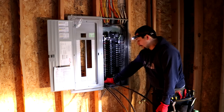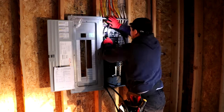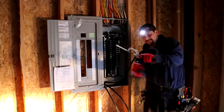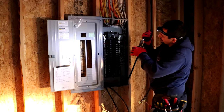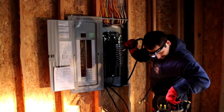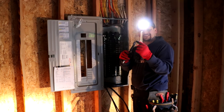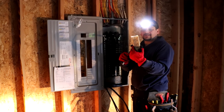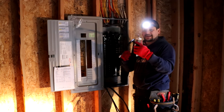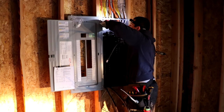I'm going to route one of these first and then show you what it looks like when I'm all done. This is aluminum wire, so it requires that you use an anti-corrosive compound. This stuff I pick up at Home Depot or Lowe's — it's OxGuard antioxidant compound made by Gardner Bender. It's a black goop and I put a pretty liberal amount on it, getting down inside the lug pretty good to make sure we don't have any issues.